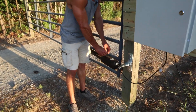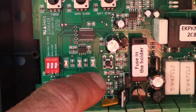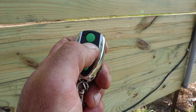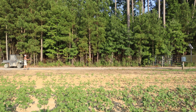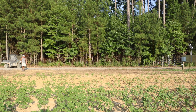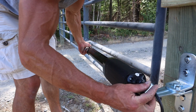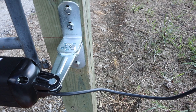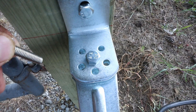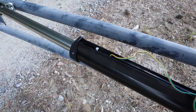But first, let's go back over to our actuator and make sure we have it back into operating position. We want to put the key on there and turn it 90 degrees clockwise. To program the remote, we come over to the control board and press this button. You'll see the red light will light up and then press this button twice within two seconds — and that remote should be learned. I have to be within 40 or 50 feet of my gate before the remote can work, and I think that's majorly due to it being inside that metal box. If you're not using a metal box, you'll probably get more distance out of your remote. Now it's going to be a good time to set the stop on here. First we want to flip the actuator upside down — this will just make it easier to see what we're doing. So we're going to flip it over, put our pins back in. And my gate will not close all the way — the actuator is actually running out of rod. So we're going to pull this bolt back out and adjust this bracket over just one more hole, and that'll let the actuator push the gate around a little further.